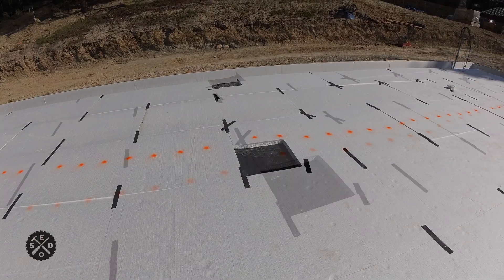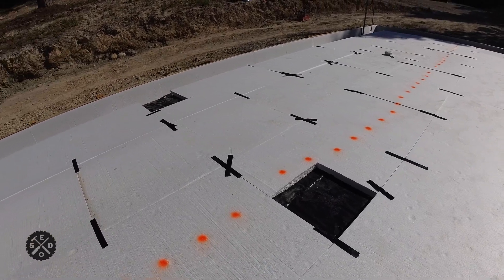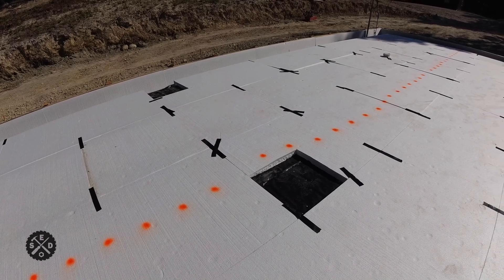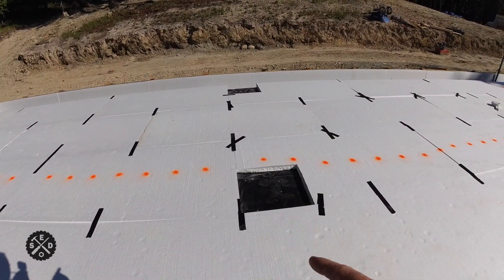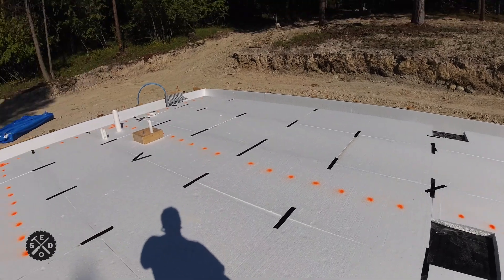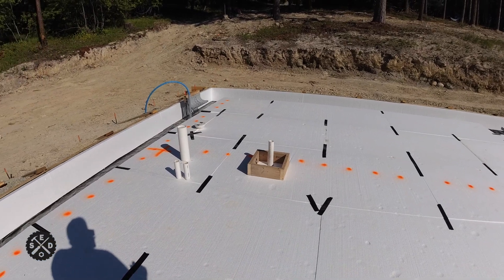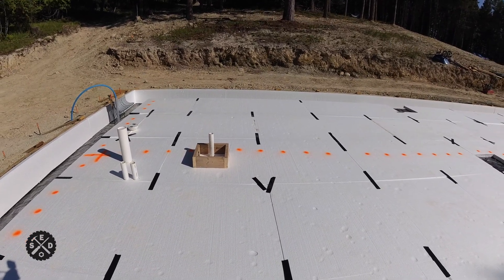I wanted to get the concrete as thick as I could, so I decided to eliminate the foam under there — that'll make it six and a half inches thick of concrete right there. I'm going to notate these measurements very carefully so I know, once the floor is done, if I ever want to put the lift in. I'm going to avoid these areas with PEX as well, giving myself plenty of room so I don't hit any tubing when I go to anchor. For the walls back here, I'm just going to glue them down with a tight top and bottom plate, so I won't need to worry about anchoring down into the tubing.